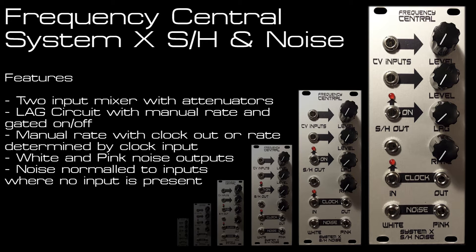It also has a gated lag circuit. The original Roland 150 that this is based on had a lag, slew and glide which was set manually, but this unit goes further using a gate to turn the lag on and off. With no input the rate is set manually, but when the input is present the lag is off until it receives a gate to turn the lag on, which can result in some really interesting patterns. This gated lag circuit is based on how Roland implemented this in both the TB-303 and the MC-202 units.